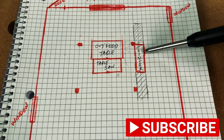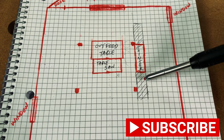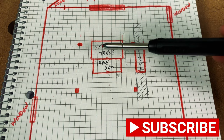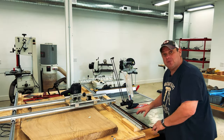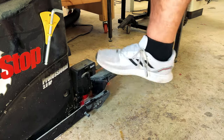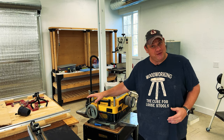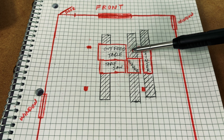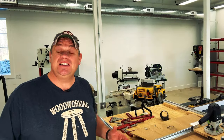This is a great example of why it's nice to have a scale model. As you can see from this red outline, that's the footprint of the jointer. The shaded area in the front and back is the area I'll need for the in-feed and out-feed. As you can see, there isn't enough room for the planer. So I'm going to make a pivot and move my outfeed table and table saw a little bit to the left — just six inches — so I can fit my planer right in here. Now I can see I have sufficient space for the planer, and I've put the in-feed and out-feed markings for both the planer, the jointer, and the table saw.